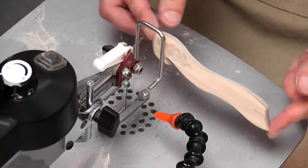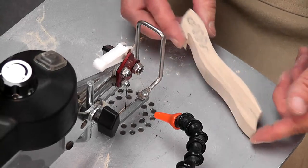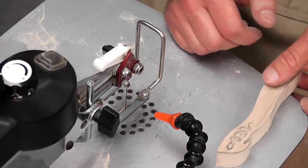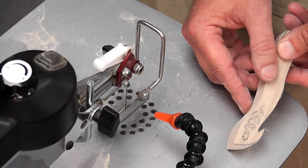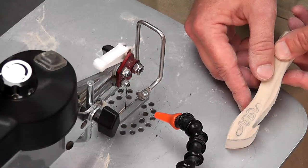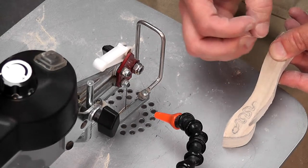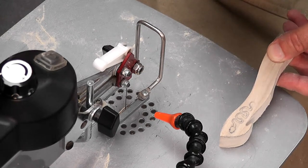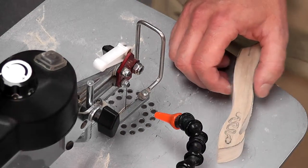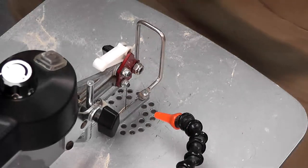You can see why we drilled that hole first — trying to drill into a face that's on an angle will sometimes really throw the drill bit out. So we've got a kind of shape to the handle of our wand now. Next thing I want to do is put a little bit of a resin infill in this. I've drawn a little kind of snake on the end of the handle, and we're going to fill that up with some interesting resin. First we need to do that internal cut, so we need to drill a hole — I've set up a very small, thin drill bit in the pillar drill.